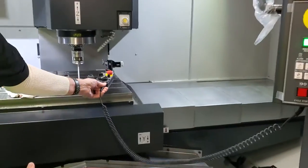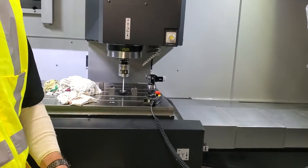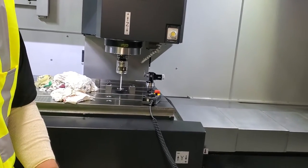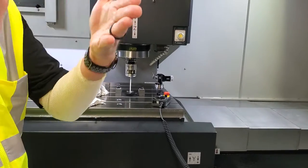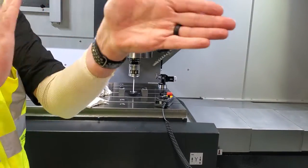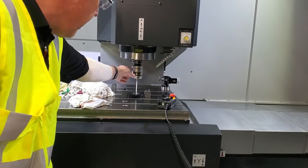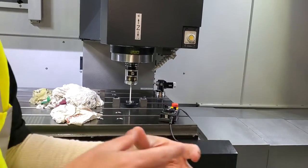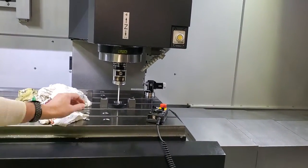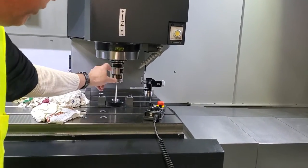This is similar to your other probe. If you break your stylus, you want to dial it in. Fix your indicator, go on your rotor, find the apex, and then it has four screws around the top right here that you can adjust to dial that probe. It also has two other screws above, up on the tool holder.